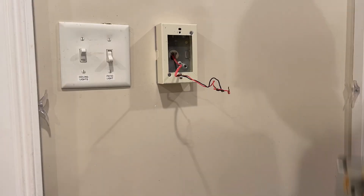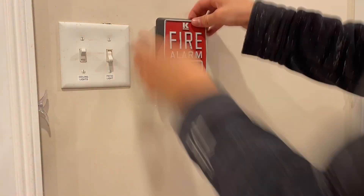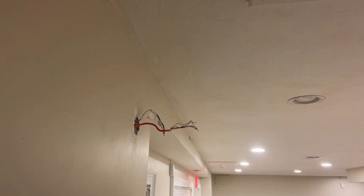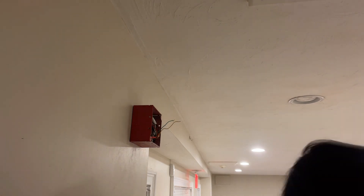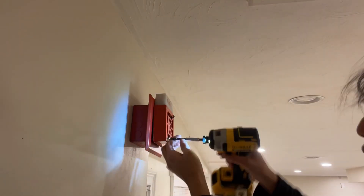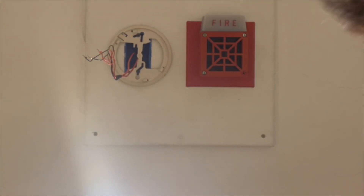Here I am replacing the rest of the devices. You can see I'm taking out this pull station and putting in a kit of B5, which is another old pull station that matches the theme well. Over here I'm installing another 7002 horn strobe using the same trim plates, which give it a really nice appearance. These trim plates are really common to see with flush plates, but because I'm surface mounting on 4x4 boxes and the horn strobe bodies sit really close to the boxes, the trim plate gives it that nice finished look. Over in the Fire Museum, I'm doing the same thing — swapping out the smoke detector and the 7002. Technically you're not supposed to ceiling mount these devices, but back in the 80s they did some crazy stuff anyway, so codes and standards don't matter for this demo.